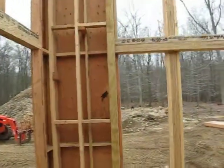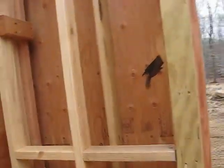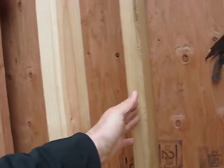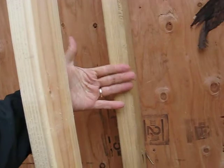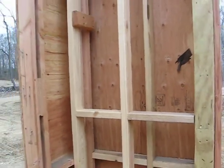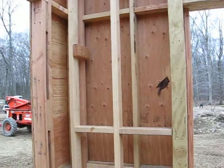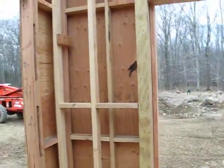And in every area, we have a double stud wall with staggered studs. The first stud staggered offset from the second stud, with a three and a half inch gap between the first and second, for a total cavity width of ten inches, so that the insulation within the house and the walls will be approximately an R-50, and in the roof, an R-70.